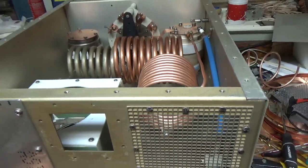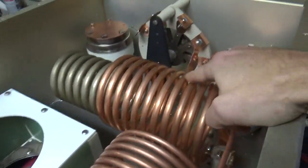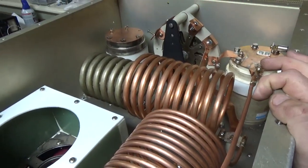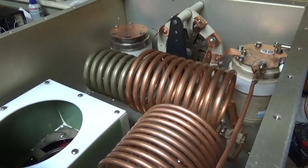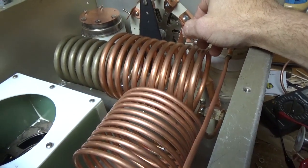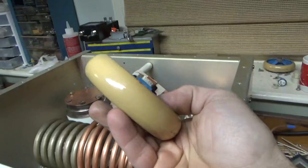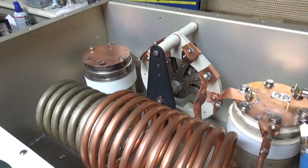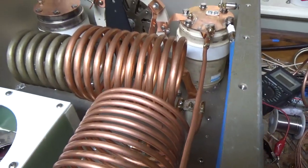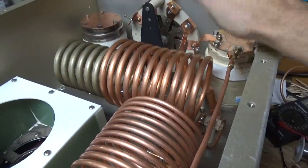The website is AmpRepairGuy.com, phone number is 203-892-4119. This material is quarter-inch OD, three-eighth OD, and half-inch OD. I'm not going to bother silver plating it — this is my personal box. If I make another someday for someone, I'll use a new cabinet and probably end up silver plating everything. This is just something I'm doing for the fun of it and I already have most of the parts. Here's one of the plate blockers — I'll be using one, I have two — rated for 1200 picofarads, so plenty of capacitance to get down on 160. Trying to keep this a budget build, but all the components I'm using are sized to support 100% duty cycle.